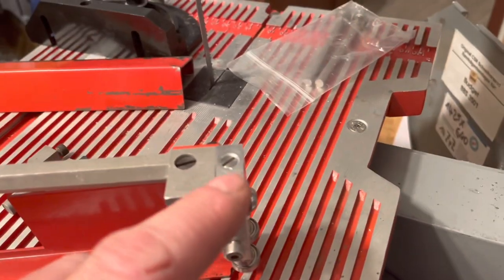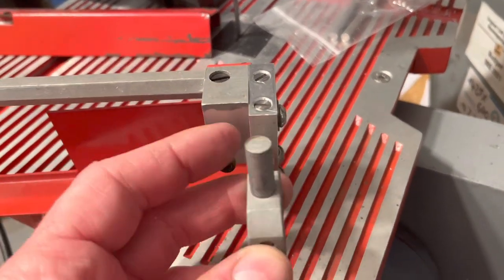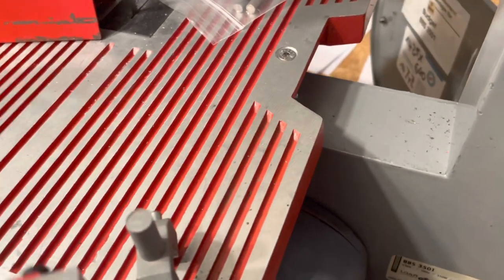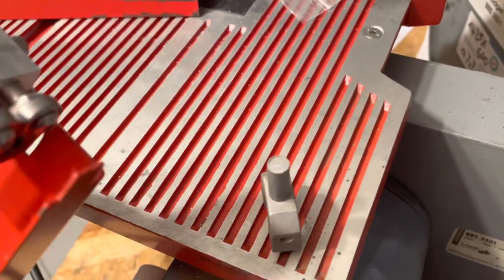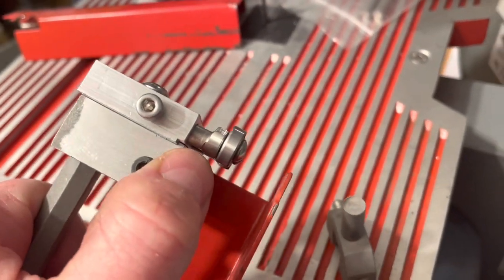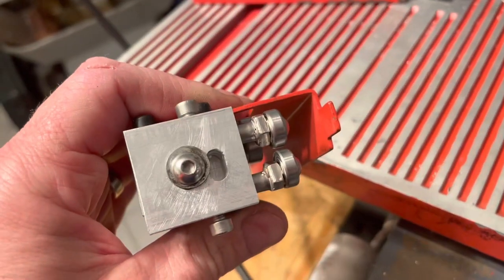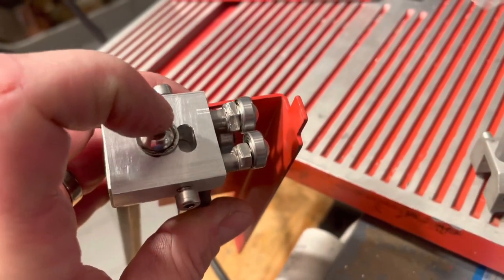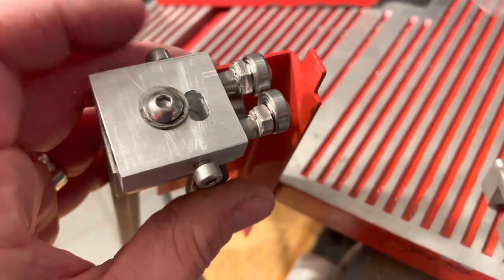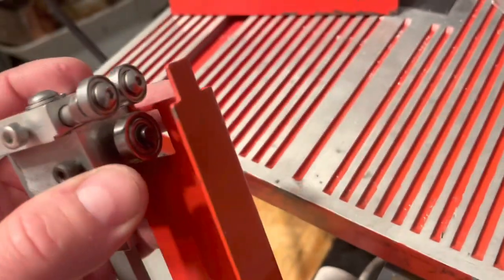And I took off the part where initially this guide here was mounted. There was a hole in there, and this thing was mounted in there instead of the new aluminum block that we have here now. I left a very small step here so that I can align the block against the step. Used one screw with a slot here. The first one here was not right, so that I can move the whole block from side to side a little bit.